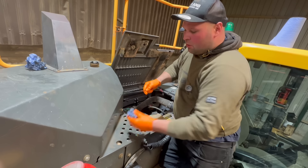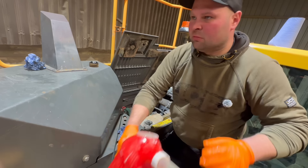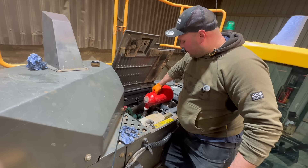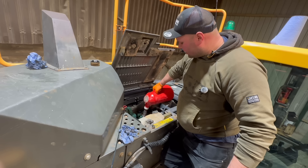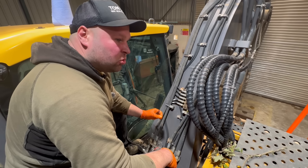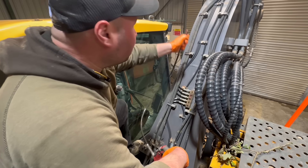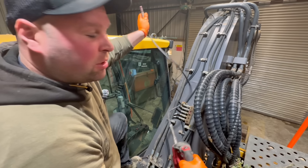We're literally near the top on the dipstick — we need to go a little bit over maximum because that oil filter on the side that we filled will take about a litre. We'll put a little bit in for that, then run it up and check it again after a couple of minutes just to make sure we're about right. Check the engine water as well. Got the cab filter to do, got the air filter — I might wash them up here. Got greasing to do — there's a whole bank all down the boom.